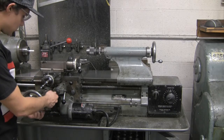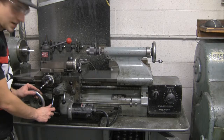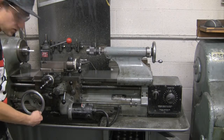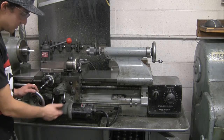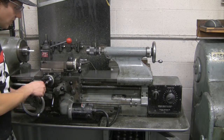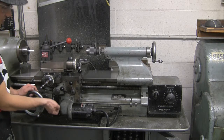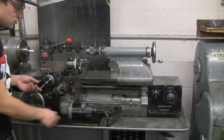They don't turn it on, per se, but they activate the axis that you want to use. And this one right here, the one on your left, is for your X axis. Up is on. And you can see now the wheel does not turn here because it's controlled by the motor. And this one is for your Y axis. Again, the wheel doesn't turn because it's controlled by the motor. And you can, potentially if you wanted to, have both on at the same time. And now they're both controlled by the same motor.